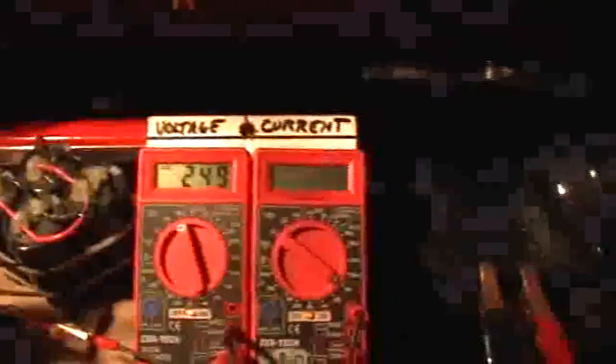The ring oscillator is flashing faster with more voltage. That's at 200 volts per division, so we're looking at about 420 volts peak to peak. We're rectifying that, so we're up to 240–250 on the capacitor — and that's actually the voltage limit of that capacitor. So I'm going to turn down the input voltage and unplug the capacitor. Now we have 237 volts — 235 volts trapped on that capacitor. I'm going to show you what 200 volts and 260 microfarads will do.